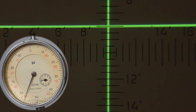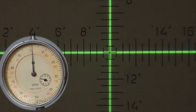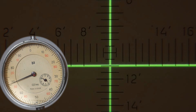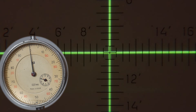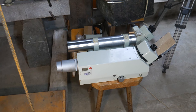I set the scale to 0 and change the mirror's tilt angle by 1 arc minute, raising the right edge by 0.29 mm. The test confirms the accuracy of the instrument's readings. The instrument has been tested and is ready for sale.